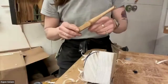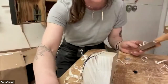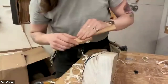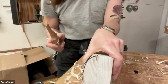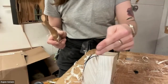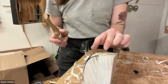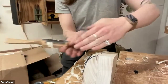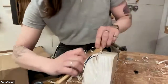The cool thing is when you get into a form like the cabriole leg, and maybe I should show you my screen again in a minute, once you've seen this in the context of this extremely simple application. But if you imagine that this, instead of being a blank of equal size throughout, was tapering, then what I would do is choose my shape two line, which is the center of that cabriole leg edge. And then I would form my little 5-7 breakdowns. And so I'd be moving a ton from the knee, very, very little from the ankle. And it would just start to form this incredibly sinuous and beautiful leg.